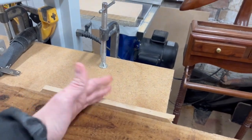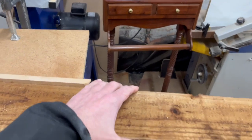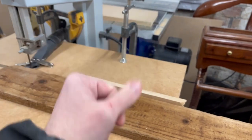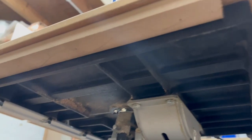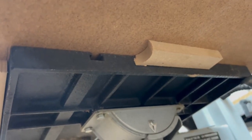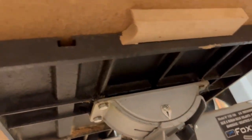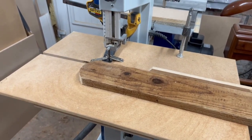It's only on one side because it only needs to be on one side — I can hold the timber with my hand and pull it through, so I don't need to clamp it. A hand clamp does the job. Underneath, I've just fitted simple cleats, just nailed them all around the table, so the jig can't move on any of the four sides — just half-inch off-cut cleats. I'll take the jig off the table and show you the pivot point.